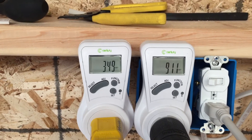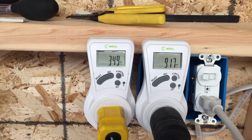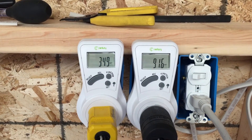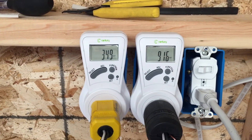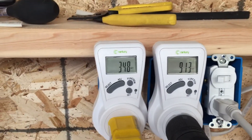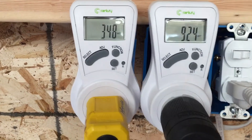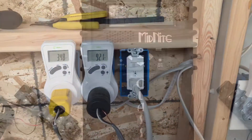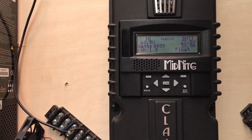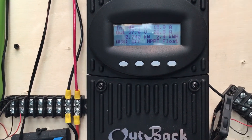So yeah, dry takes the most energy it seems like. Turn on the light so I can see the actual machine — it's working so far. So there's the security camera, bedroom, AC living room, and kitchen. Now looks like everything's kicked on in the kitchen too. Let's see what we're doing — 940 to 950 watts, 34 amps going in, then 26 amps going in on the Outback.